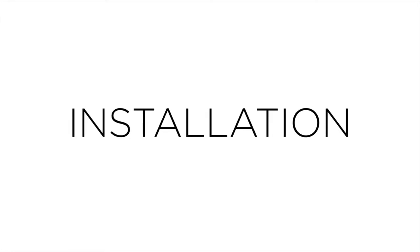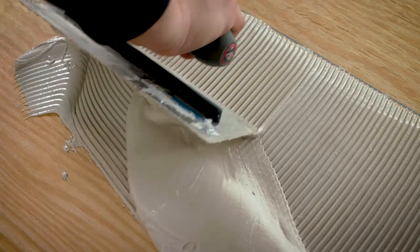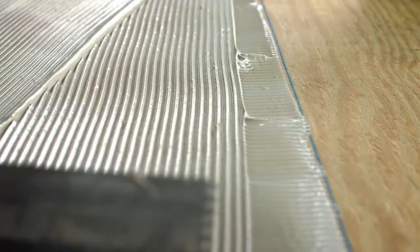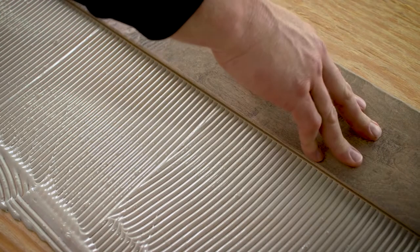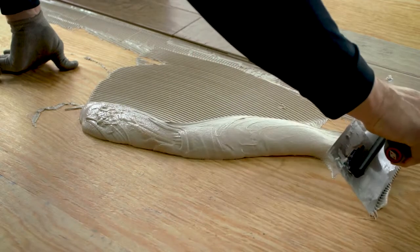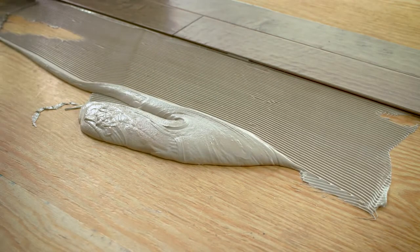Now gently disengage the planks you've laid in the first two rows so you can begin gluing. Hold the recommended trowel at a 45 degree angle to ensure the proper spread rate of adhesive. Apply pressure to allow the trowel to leave ridges of adhesive on the substrate with little adhesive left between the ridges. Spread the adhesive from the chalk line out to approximately the width of two planks. Place the tongue of the board into the grooves of installed boards and press into the adhesive. Maintain a six inch minimum space between end joints as you proceed. Install the first row of starter planks along the chalk line with the tongue facing the starter wall. When the first two rows are straight and secure, spread the adhesive two to three feet wide across the length of the room. Don't spread more adhesive than can be covered in 30 to 45 minutes.